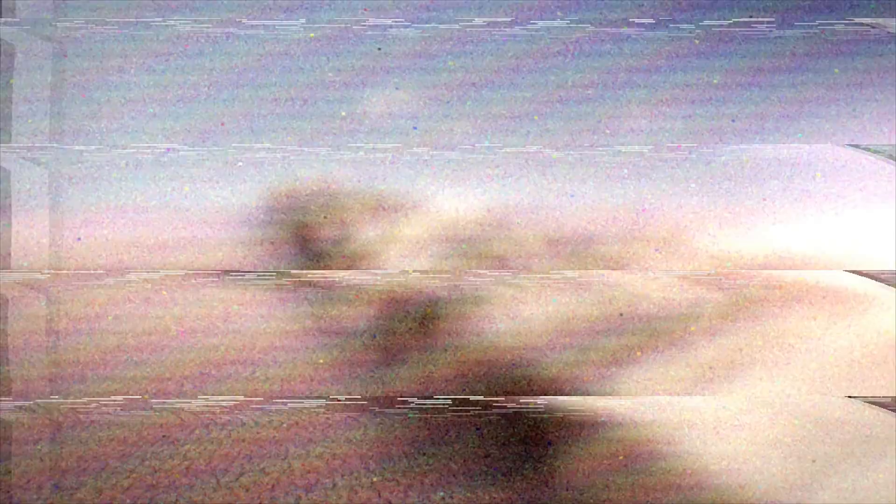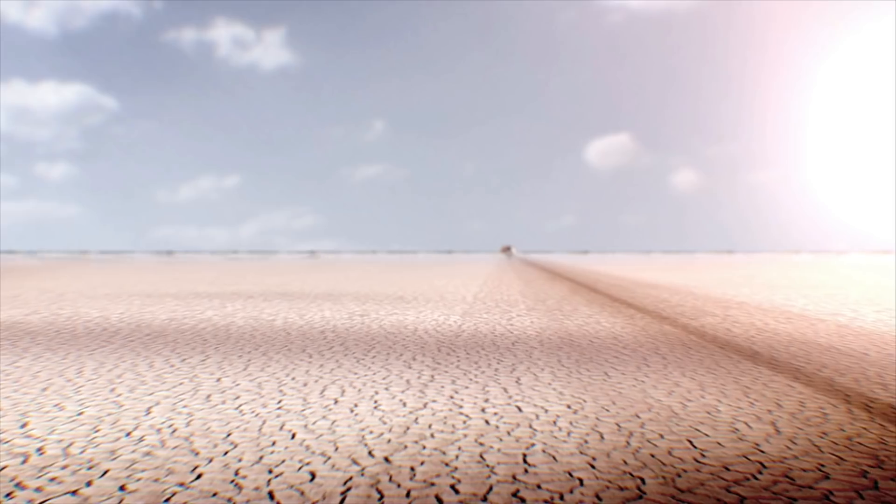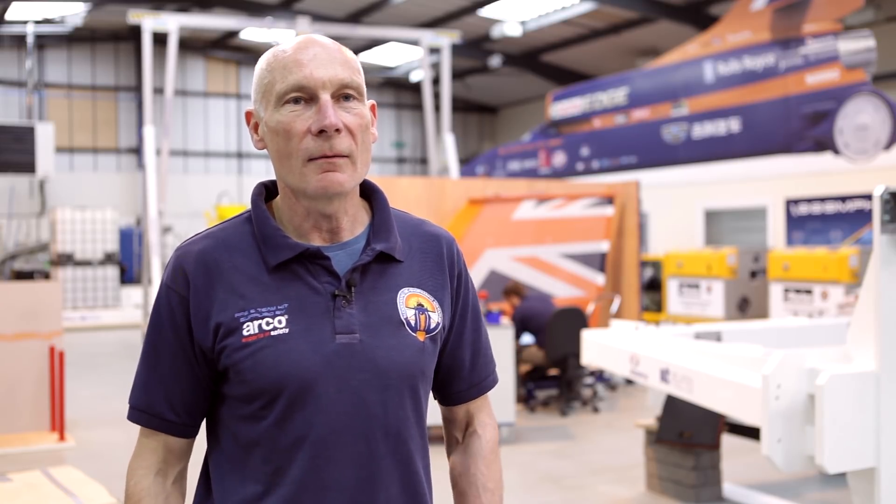You could get a frequency running along the desert — you might get a series of bumps which can be at the same frequency and set off some vibration of the fin. That, coupled with some aerodynamic turbulence or something like that, can start a flutter. So we need to look at that.